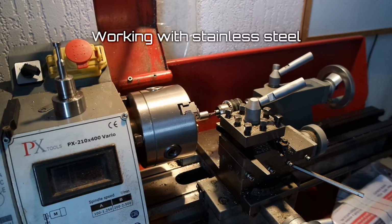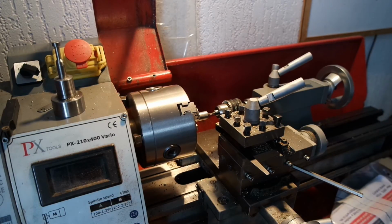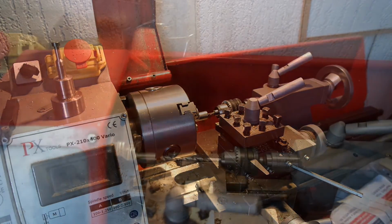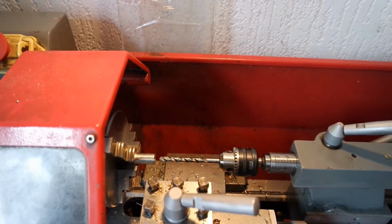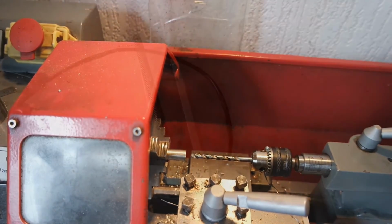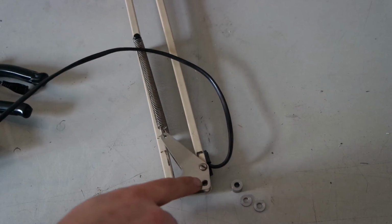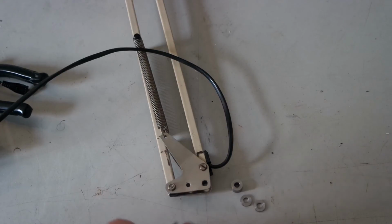Making some spacers. First center drilling with a 5% cobalt center drill. It's a 1mm drill. I'll touch up the surface and try to part off some discs. Drill to 5.5mm in 2 steps. I finished these spacers, and I drilled out this hole just to see what would happen if I attach this one directly to this hole before I start making new holes.